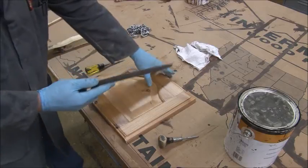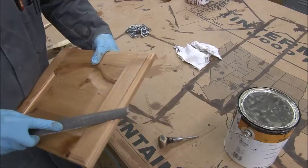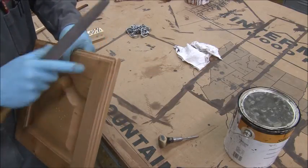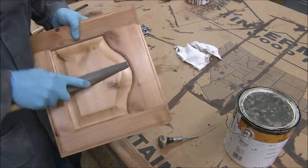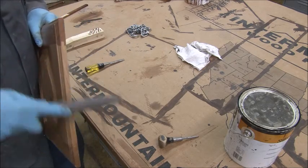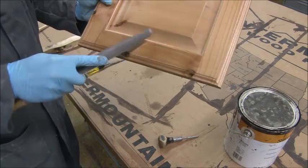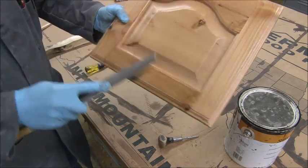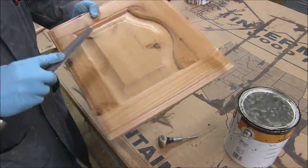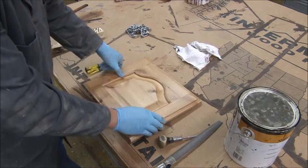Now the file is very simple. You take the file, and as if the door got scuffed on the edge or rubbed against something, it scraped there — that's all you need to do. Scrape an edge. If you want to take a corner off a little bit, hit the edge and corner, and just go around and find certain areas that you want to scuff up as if it was aged. You can even hit it to leave dents where the sharp metal pieces are. So that's called filing.